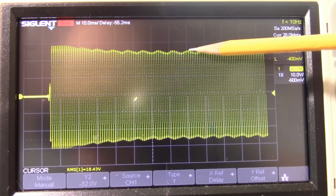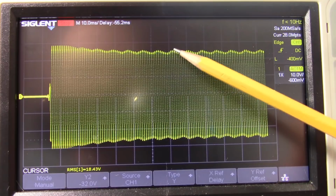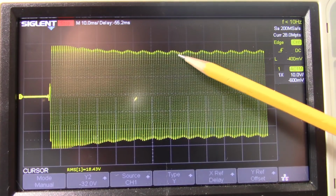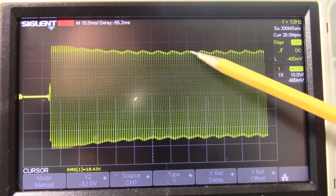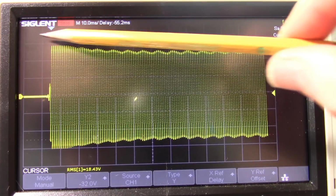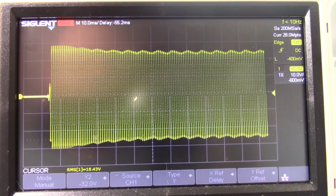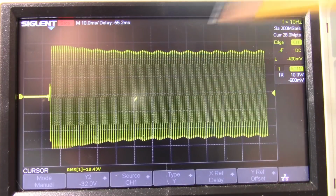And of course, with larger capacitors, this ripple will be smaller because you have to take your maximum clean power at the bottom of that ripple, because you can't use the top, because at some point in the signal you could be clipping on that bottom part. And that's one reason why some of these high-end power amplifiers have huge amounts of capacitance. Gives them a nice long time constant of higher dynamic power range. It could go through a longer bass note in music, maybe a bass drum kick, where with this arrangement it can't. And you also get smaller ripple as well.